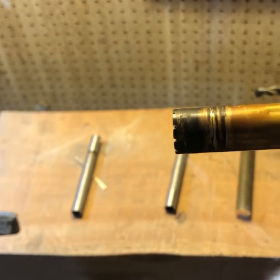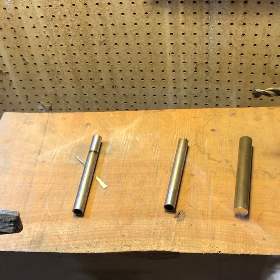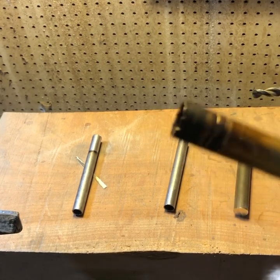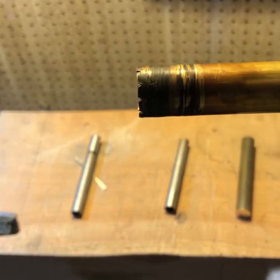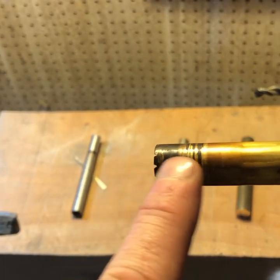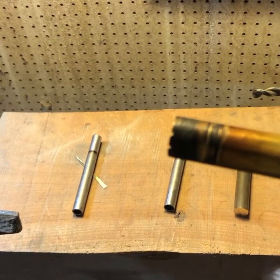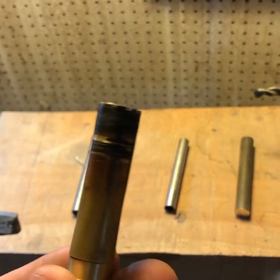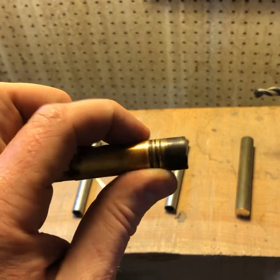And the second I did this and I put it into the drill press, I didn't have any hopes for it. I pressed in and it drilled right through there. The teeth did not bend out. I had no issues whatsoever, other than the fact that the metal is super soft and it kind of burns through the wood. You can see the black marks from it burning into the wood, which was not an issue. Even on the maple, even though it burned into the maple, once I set the veneer in there and then turned away the top layer, those burn marks kind of just disappeared.